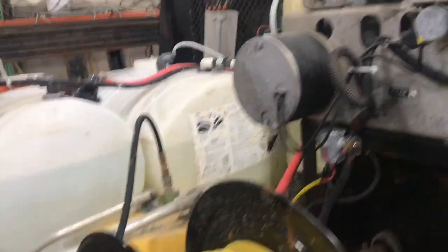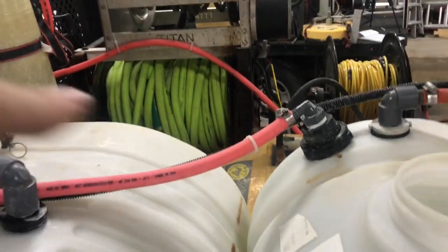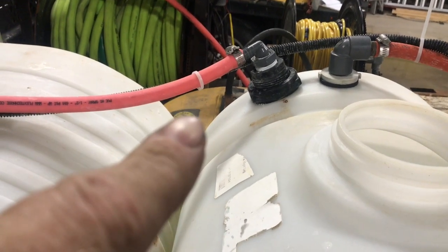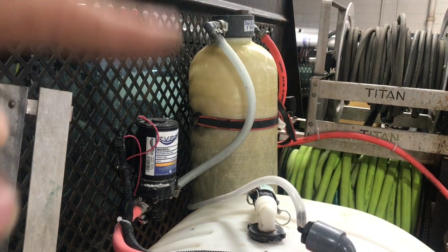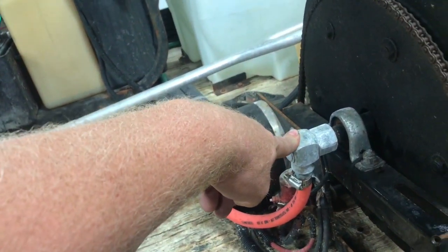The next thing I want to show you is part of the plumbing. That orange hose right there goes into a tube that runs all the way to the bottom of the tank through a bulkhead fitting. From that tube we come over here to this little 12-volt pump, and with this pump we pump water out of there and it goes up into this deionized tank — that's how we get deionized water. It comes out of there and runs over to our hose reel. It's nice flexible hose and we do use a swivel here because it's not very high pressure, so we don't have any issues with that.